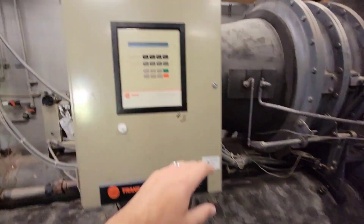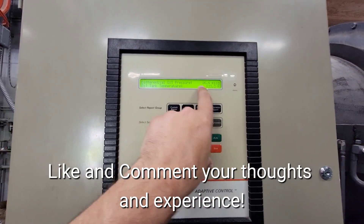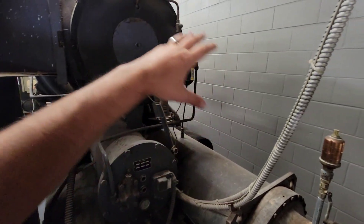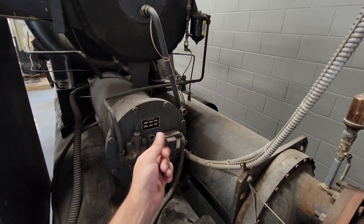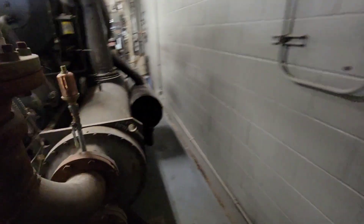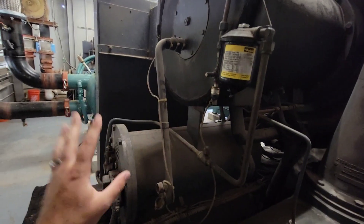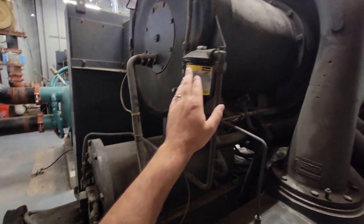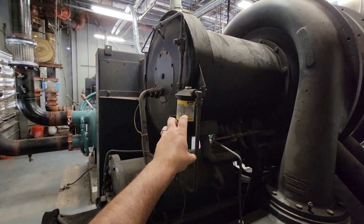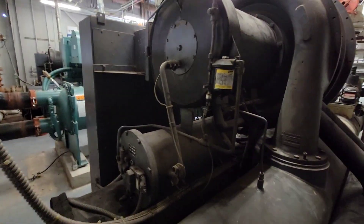Going through this one I found a couple of different issues. One issue was the oil differential pressure was a little low. We've replaced all the oil in these machines because it was really old and deteriorated - it had a really dark color with visible trash in it. We've done all of that, but that oil filter needs to get replaced. These filters you can't just buy anymore - they don't manufacture them and the conversion kits don't fit these really old machines. We actually found a supplier here in Texas that still makes the filters by Parker, so we can still get the filter cartridges and still service them.